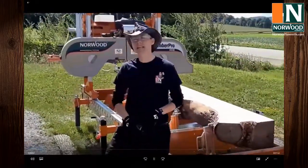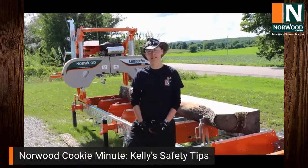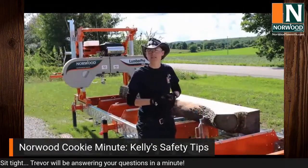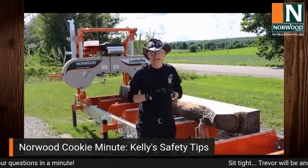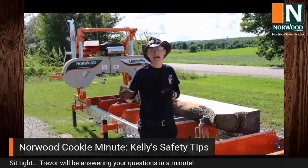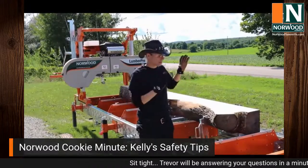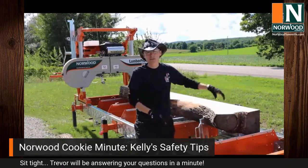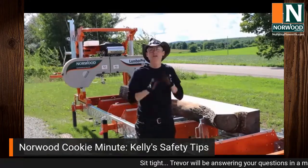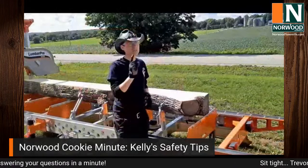First thing I wanted to talk about today is fire safety. I know most of us don't think about fires with the sawmill, but it's a thing. I know at the end of the day, you're all done, you're tired, you're looking back over the sawdust and you think nothing of it, but that's where it's going to get you. At the end of the day, you've gone home, you might not be near your mill, and that sawdust will catch on fire. And it will create huge problems, not just for your mill, but any structures around it. We know from experience that this can happen, so please take the time, rake that sawdust out, make sure you're good, clean it up, so you know everything's okay for tomorrow. Fire safety was tip number one.